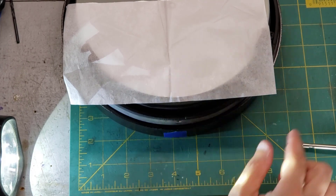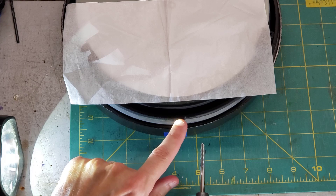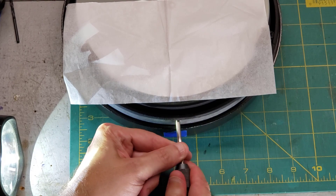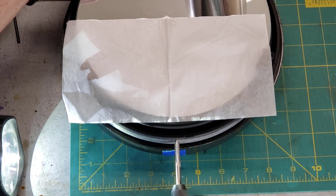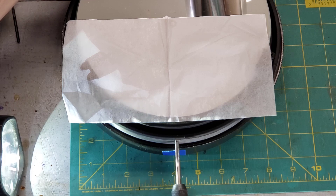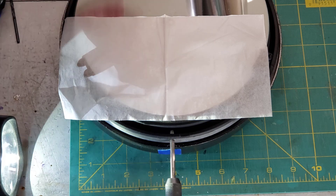Here's the tap. I have some protective paper over the mirror — this is pretty soft aluminum. I've already put the drill bit in; it's so stripped out that the drill bit for this tap went in pretty easily. I'm going to try to gently tap this. It's going in really nice and soft. The technique is a little bit in and then a few turns out, repeating that process. It looks like it's already all the way through — just keep going. It can only go in so far until it gets near that inner wall. That should be pretty good.